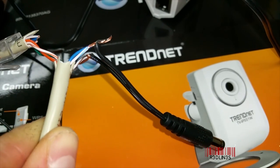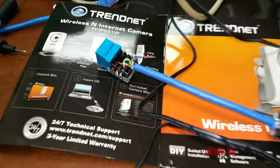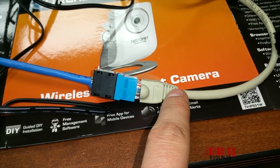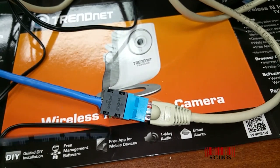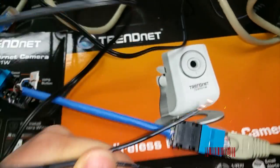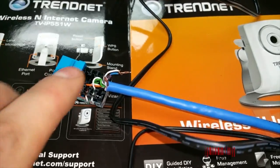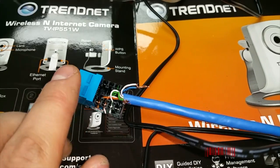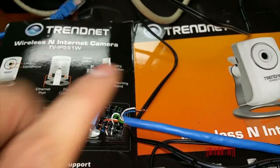Now let's go to the other end where the power is going to be served up. The reason I'm using a female-to-female is so I can put it on any cable and my cable length doesn't matter. If I injected power directly onto this cable, I'd only have four or five feet to the camera and that's it. So I strip back the wires and put it on the female-to-female — this side is the camera side, this side is the switch or router side. Here's the key: I've pulled off my brown and blue wires, and we do not want to push power backwards into the switch — that would be bad. So I disconnected those pins on the switch side so no power goes that way.